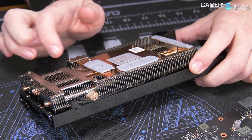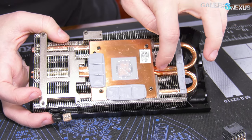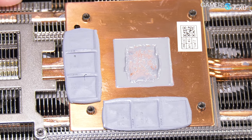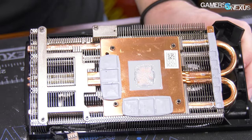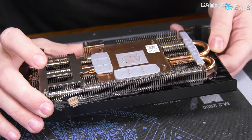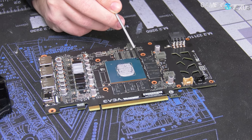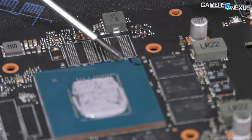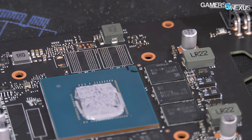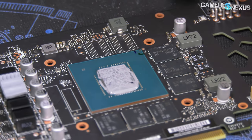It's just two heat pipes going through the center of the die. If you wanted a more expensive cooling solution, four six-millimeter heat pipes would connect pretty well through the entire silicon diffusion barrier, but they've gone with two in the center. It's not optimal, but it's optimal for keeping it close to MSRP, which is hard to hit for board partners on these cards. There's also a marking on the board — in the past we've asked EVGA about these marks on GPU substrates, and they tell us it's a QC mark and not a binning mark — just a 'it works or it doesn't.' It could also be something as innocuous as an alignment mark for the cooler.